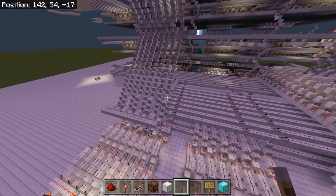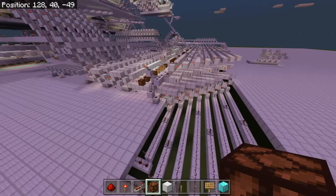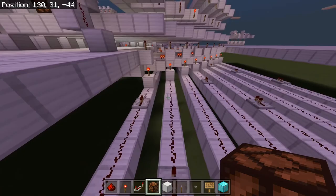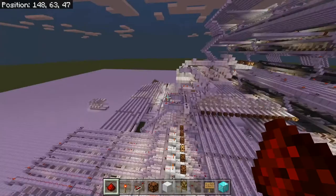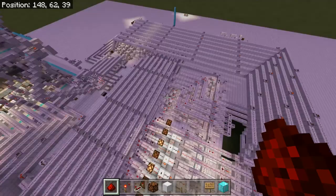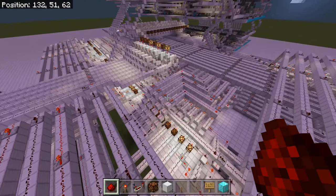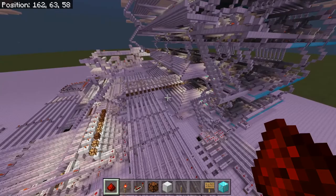So on every clock edge, the data input to our memory is going to change. The A register is changing, the program counter is changing, and so on, and then I'm going to look at the inputs to the operand register to see when they update, because I will also enable the write operation. So this will take the data from the previous cycle's memory and save it into the memory. Now, this may be going too fast for the memory, in which case it would be requesting that it saves it before we really know what's going on.